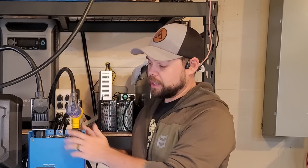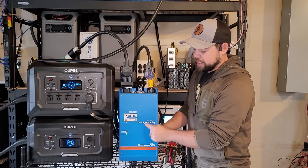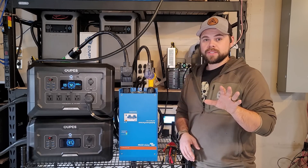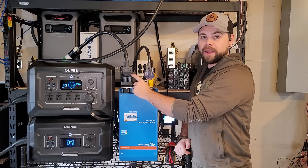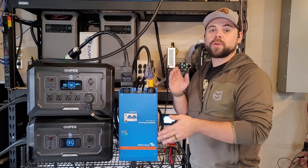The next part is where it gets tricky — how to wire this auto transformer. It's currently upside down because it has a flat top, and this section is where the huge copper coil is that allows it to convert 120 volt power and spin it up to 240 volt split phase power. Split phase power is technically called 120/240 volt split phase power because you're still getting 120 volts out of it — two legs of 120 volt put into a split phase, meaning you can get 240 volts from two 120 volt legs.